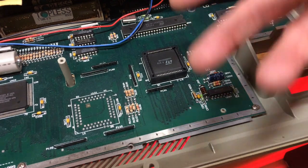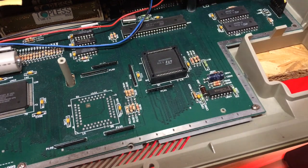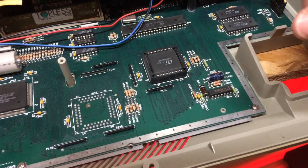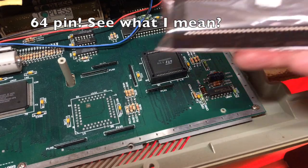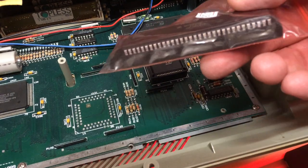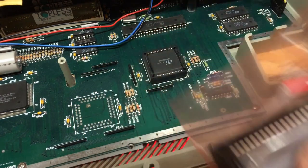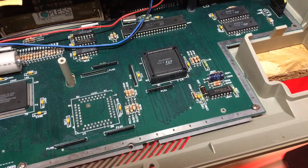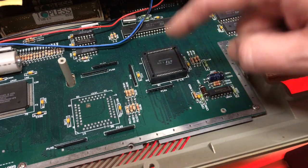If you look at all of the Terriblefire boards for the Amiga and the STF, they plug into the 68000. TOS decoder ROM plug into the 68000. And the problem is that the old school 68000, the 64-pin version, and I happen to have one here by way of example, nice, great big profile, easy to solder, 2.54mm, 1/10 of an inch legs. Just get a nice big socket, put that in the board, and get some pin headers, and you're away. You can attach an upgrade quite simply. But this is a very difficult thing to do.